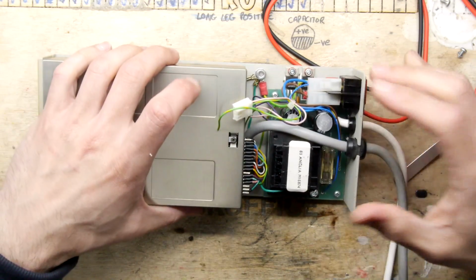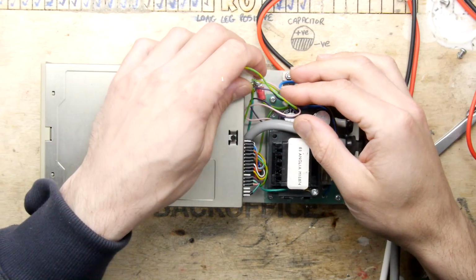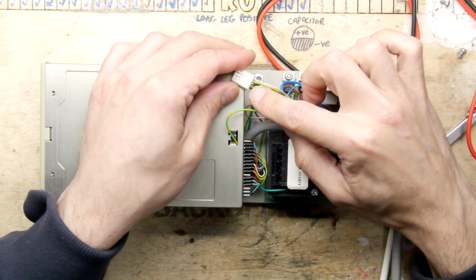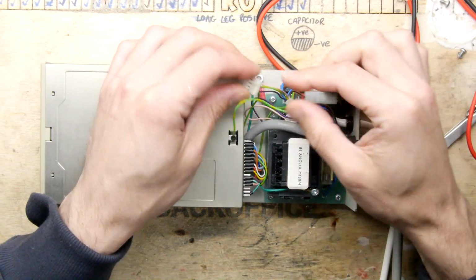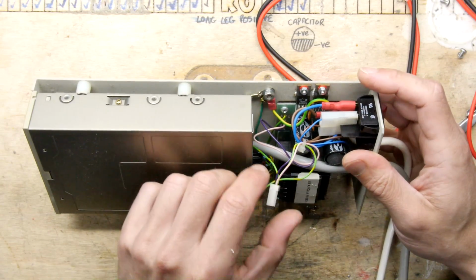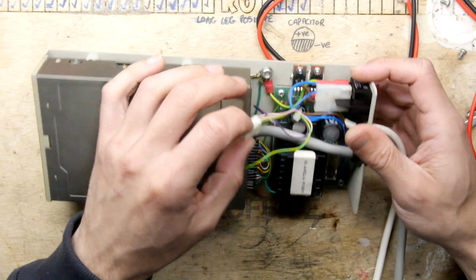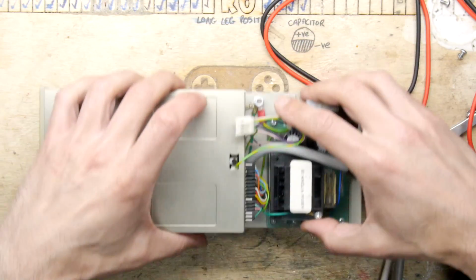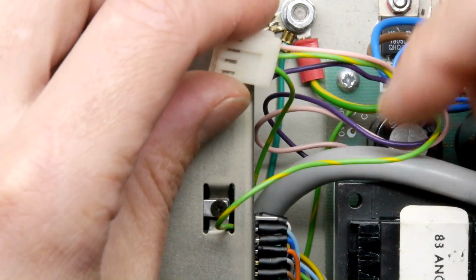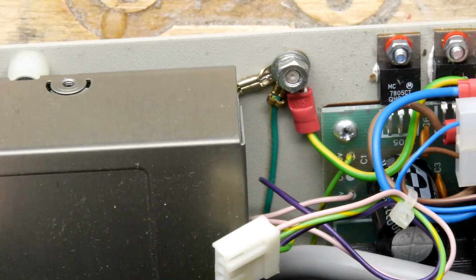And then they've got the power wires that are coming from here, and it looks like to me, this nomenclature on the colours means that you've got 2 grounds and you've got 2 outer ones, and sometimes it's maybe a 5 volts and a 12, but I'll have to check the specs. I'm just guessing at this point. I don't know drives too much. In fact, I can see the PCB. You have 2 0 volts, you have a 12 volts, and you have a 5 volts. So the pink is a 5 volts, and that's the outer wire, and the purple is a 12 volts, and that's the inner wire. And you're supposed to have 2 0 volts, but only one is connected. So I think that's probably our answer.